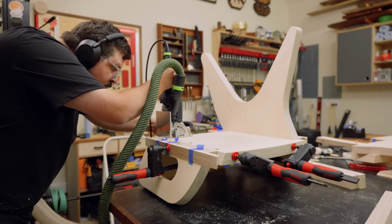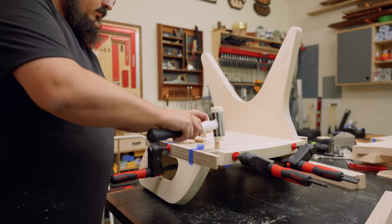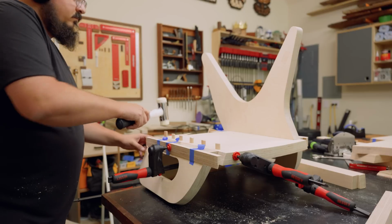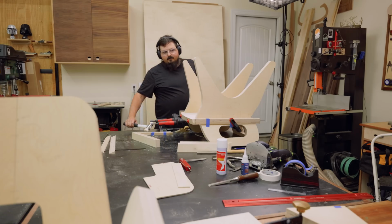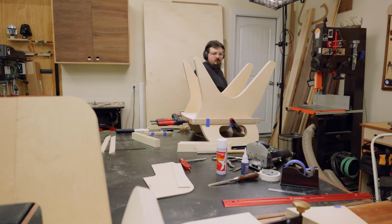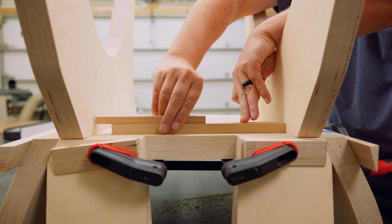One other pretty important part of the design was the fact that the rear tenon for the backrest goes directly into the leg vertically. I was concerned about how the backrest would attach to the seat and if it would have enough strength to be a backrest. But with the additional longer tenon adding vertical strength to the horizontal joint, I felt confident about the structure. With the legs in place, it was time to cut down the stretcher and apron parts.